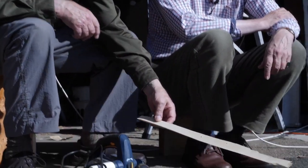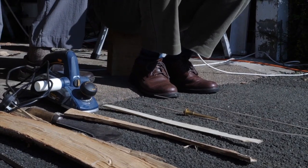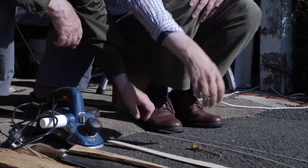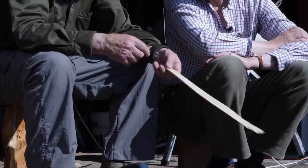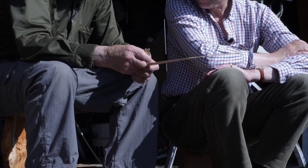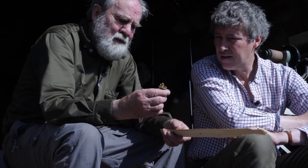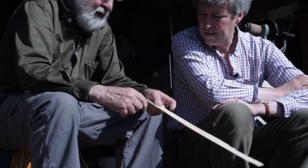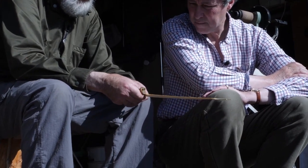That's just a rough bit. And you're aiming for roughly 2 millimetres plus a bit before you take it to the sander. Yeah. And then I would cut out using that tool. So what's this? You call them a cutting gauge, I think. You usually get marking gauges which have a little point on them, but this has got a blade on it. So if you cut it like that, it cuts into the wood. Strip. Yes, it cuts the wood to the right thickness.